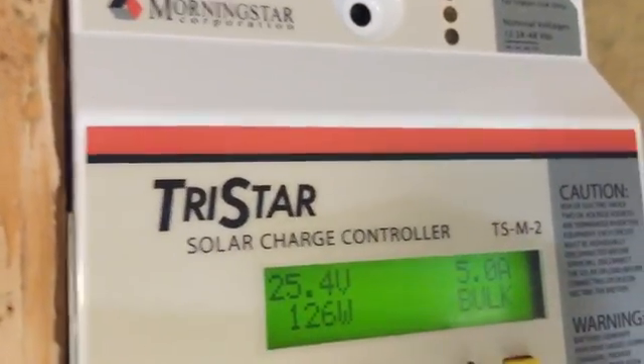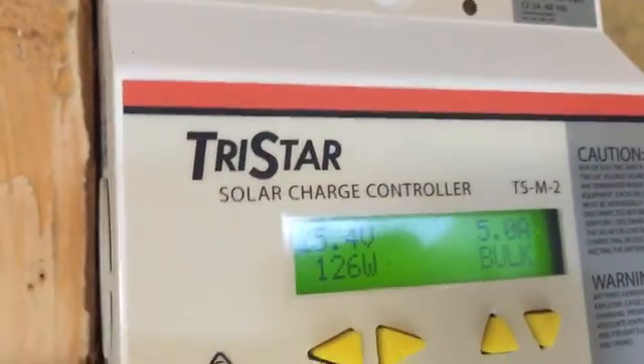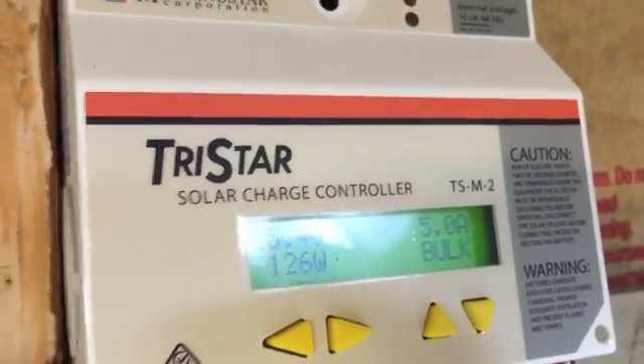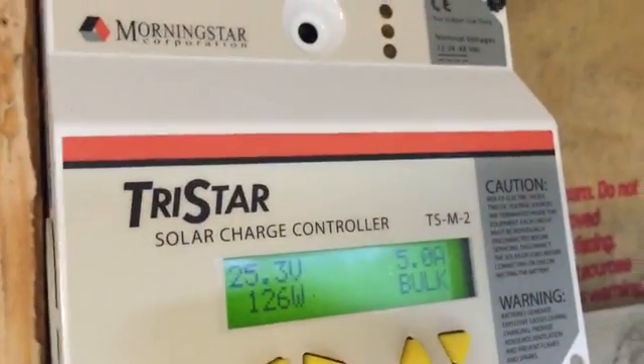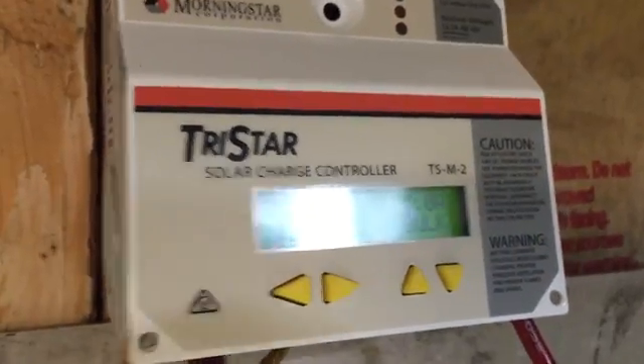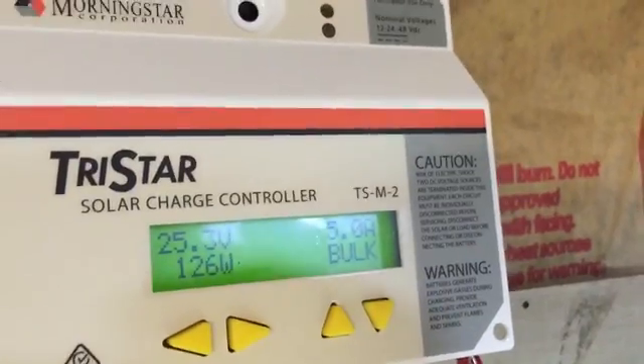It's just not quite enough. There goes the fan on the power inverter kicking on — the voltage has dropped and we're only pulling five amps. I really probably need to change out that 14 gauge wire so we can get more current, because it's such a long run. I'll keep you posted — thanks for watching.